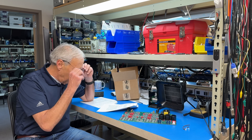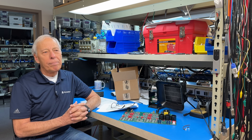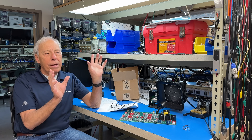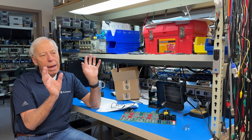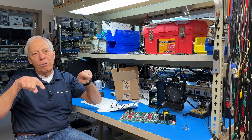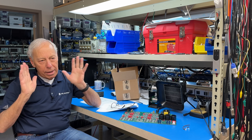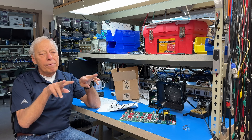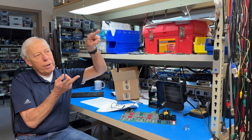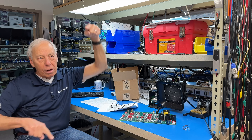What are we talking about? Bridged amps. First off, a bridged amplifier will be twice as loud as a non-bridged amplifier, because it doubles the output voltage. Imagine a stereo amplifier where the left channel is putting out 10 volts and the right channel is putting out 10 volts. If you flip the phase on one — so as the left channel goes up the right channel goes down — and then connect both to one speaker, you now have double the voltage.